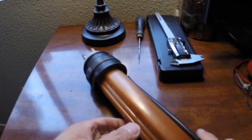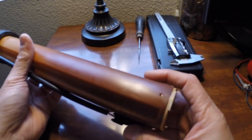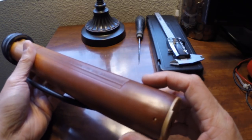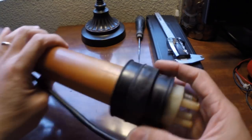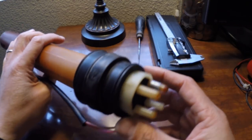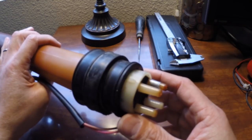Here are all the clamps for the hose. Make sure you identify all your hoses — one, two, three, four. Mark number one; it doesn't matter how you mark them, as long as you put them back correctly. Here's the fuel sending unit — I took it out of my 1997 Sea-Doo GTX. Before you get started troubleshooting with this sending unit, there are a few things you could probably do before taking it out.